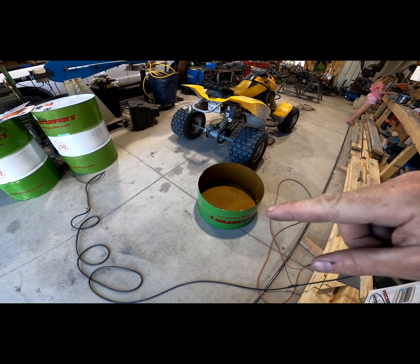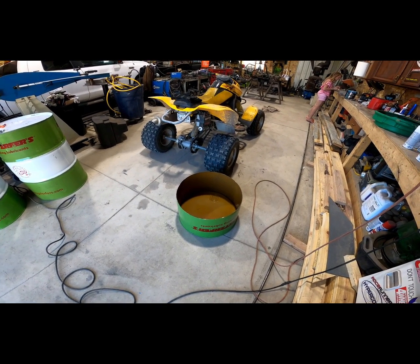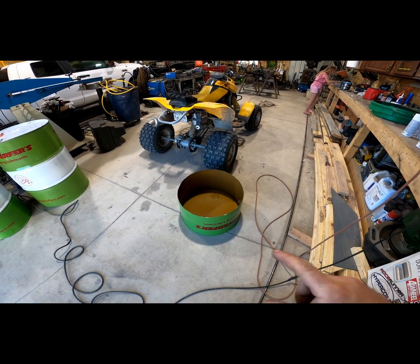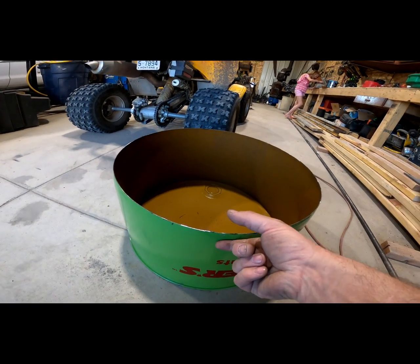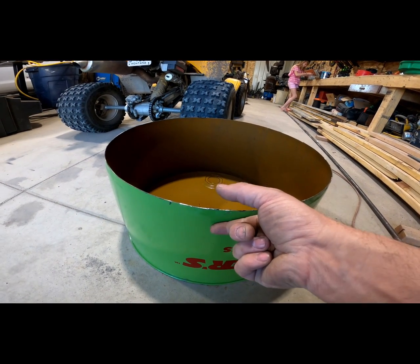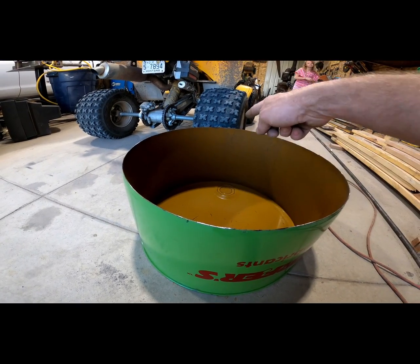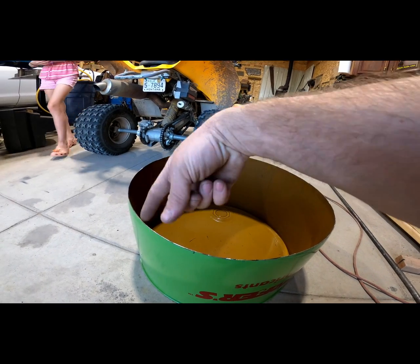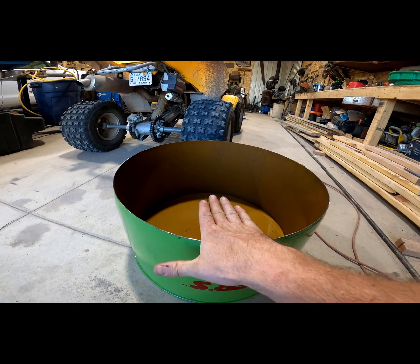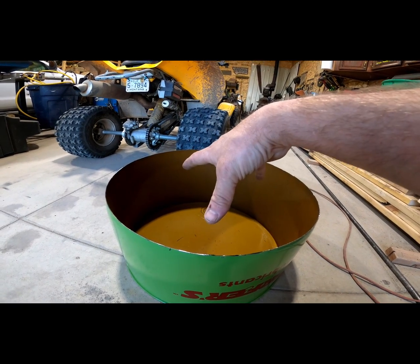I'm gonna do all this out of 1/8 is what I think I'm gonna do. 1/8 wall. It'll be 2-inch. The good thing about doing 2-inch on this top, when I make my grating, I'll be able to do 2-inch here. Then I'll be able to weld my 1-inch strapping, because I'm gonna do 1 inch by 1/8 going this way to make my slats that way, which will sit on top of here, and it'll hold the roundness of this barrel when I put it on here.